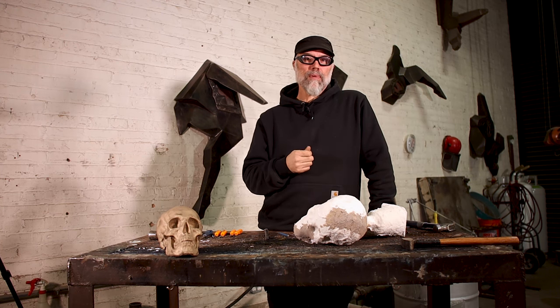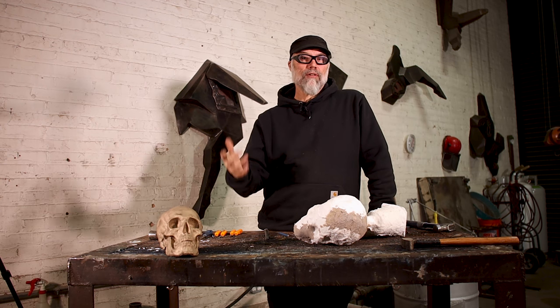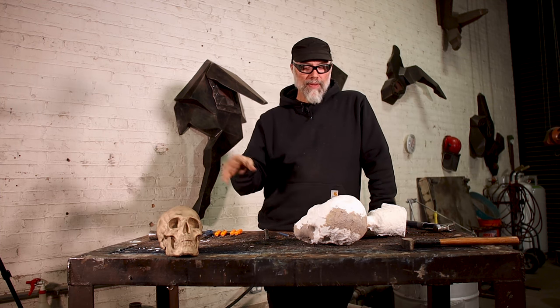A pressure washer has to be pretty powerful to actually remove any of the shell in the hardcore nooks and crannies. If you find yourself wanting to do ceramic shell on a regular basis, it will behoove you to make one of your first investments a compressor so you can run a sandblaster on it. One of the other benefits of having a compressor is that there are a number of tools — die grinders and so on — for chasing, which we'll talk about in the next video. If you're going to be working in ceramic shell, having a sandblaster is the ideal way to remove investment from your castings.